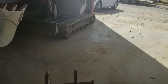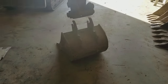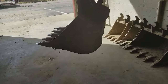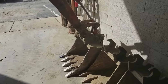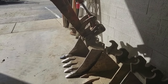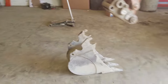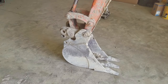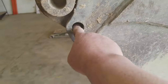Set it over here, and to drop it reverse the process. Now this bucket goes where that bucket was. We're just maneuvering buckets at this point. Set the bucket down teeth flat, uncurl the bucket, lift out. Then pick up this bucket, curl it up a little bit. What you want to make sure is that these holes right here — that's the hole you need to line up.